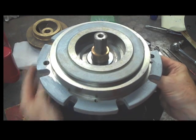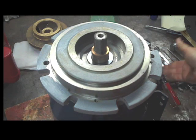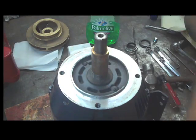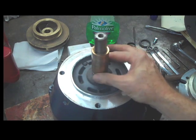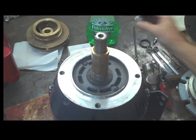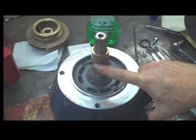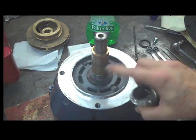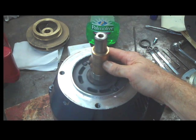At this time, we're going to take out the four bolts that hold the motor to the bracket — the back plate, the adapter — and lift that up. Sometimes you'll have to pry it a little because it too will stick. Once that's off, we are at the motor. Now, let's take a look at this sleeve. The only part that matters is where the rotating head rides — up in the upper portion. It can look horrible from the lower section down through the back plate; it's only the top part that does the sealing. So if it's gouged and corroded lower down, it doesn't really matter as long as that top inch looks okay.